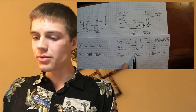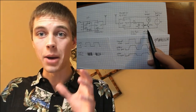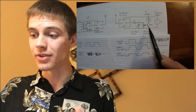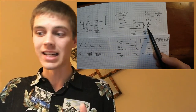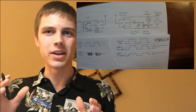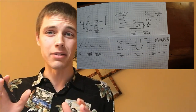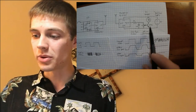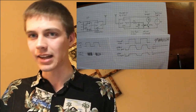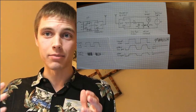And it's got the same threshold, which means that for a portion of the actual signal, the voltage that we're sending into the base of the transistor is actually above the transistor's turn-on voltage, which means that the transistor is going to turn on, it's going to conduct, and we're going to turn on the buzzer. And because DC buzzers are really weird and they've got some internal circuitry that makes them oscillate, it actually has enough built-in capacitance that it's going to sound like it stays on. It's not going to go click, click, click at 70 hertz. It actually stays on reasonably well.